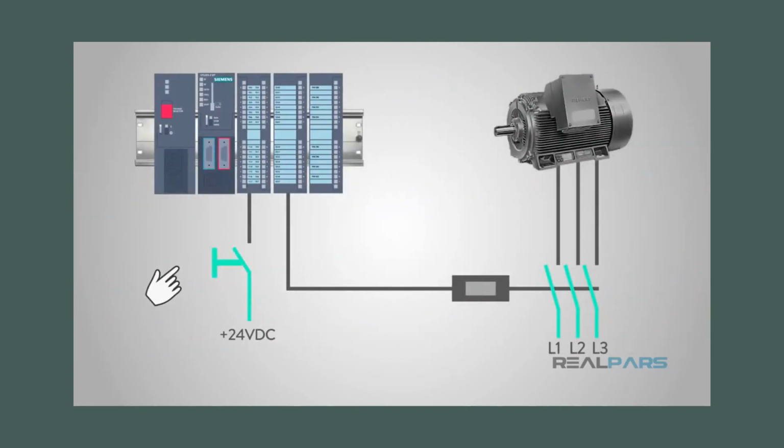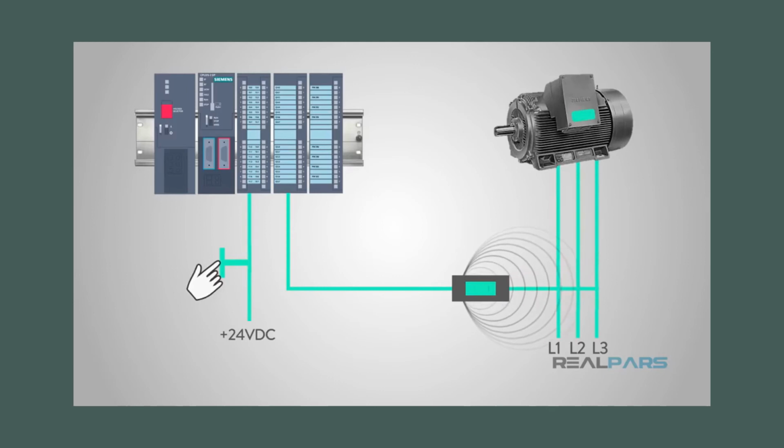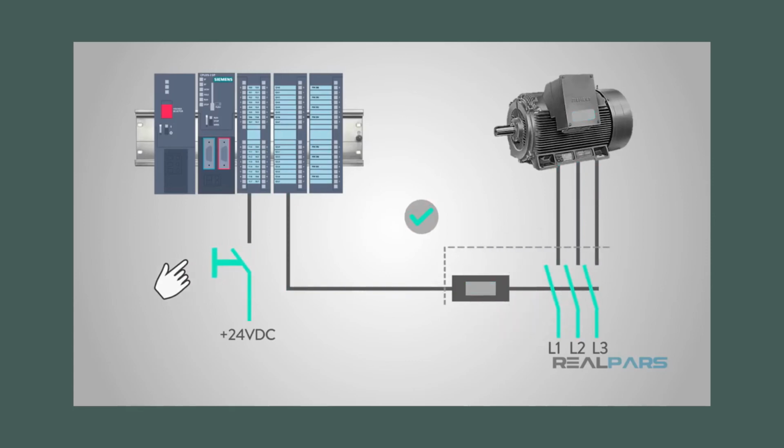Let's go back over this one more time. A relay is an electrical device that closes one circuit by being energized by another circuit. These can be used for many reasons. One that we covered today was for safety. When we use a relay to power a high voltage or high current device, while a lower voltage is used to power the controls that energize the relay. Relays are commonly controlled with switches, push buttons, and sensors.